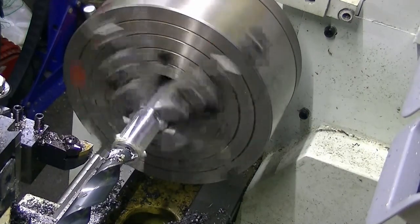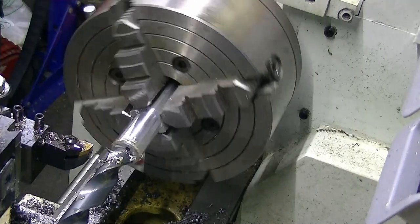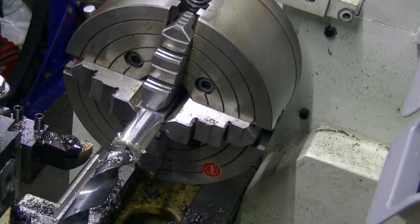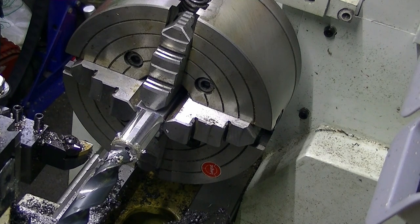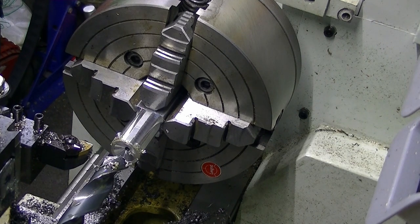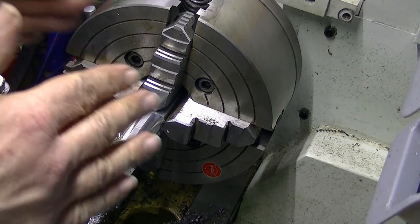So we're fully engaged there now, so just turn this off. What I like to do is push the drill bit home, and go back to a measurable point. I push the drill bit in until the quill reads a number you can read, which is 20 on the quill. So I need to go in about 16 mil, so when that reads 36 on the quill, we'll know the full depth of the drill bit at 20 mil, rather than just the cutting edges.